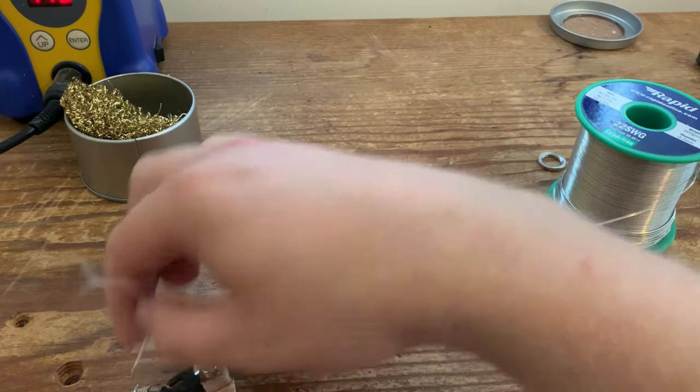Now we're just going to put the snake oil capacitors, the tone caps, in, followed by the treble bleeds, and then we can move on to hooking up the pickups. Okay, so the capacitors, very simply, get soldered onto the lugs of each tone control. If you're looking at it from a bird's eye point of view, the two lugs on the bottom here, so this one, and this one. One end of your cap goes into each respective lug and the other end goes to the ground. So we'll put them onto the pot casing there.